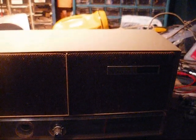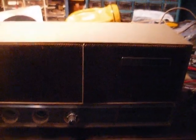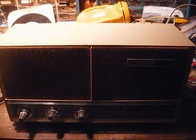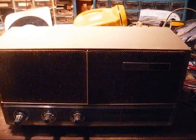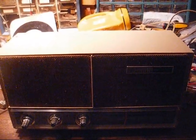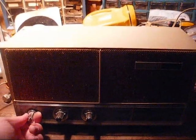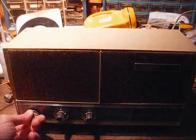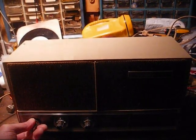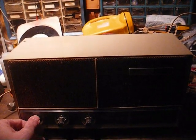Alright, come back to me. But yeah, that's about the only reason I have for listening to AM radio anymore. I have not touched the alignment on this. It seems to be pretty well spot on. However, I've got a 6-tube clock radio version buried here somewhere that I know has silver mica disease of the IF transformers. I'll get a Sam's Photo Fact for that set, and we'll dig it out one day and work on it.